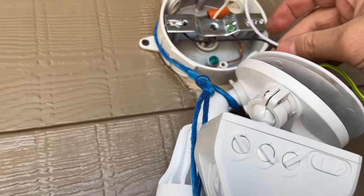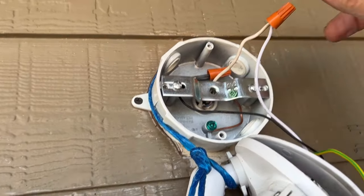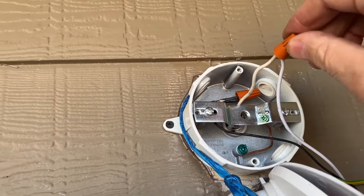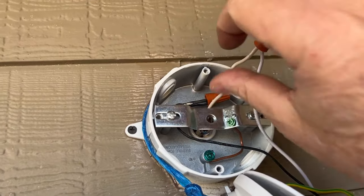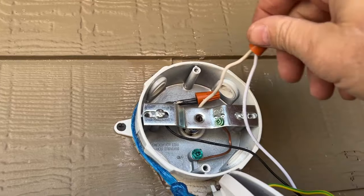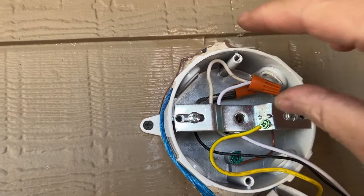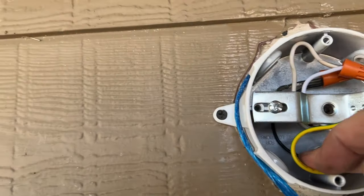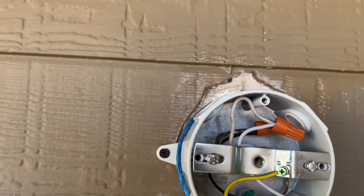Here's where I screwed up my stupid wires. My black wire I put under this so I could connect it and all my wires would be behind this. However, my white wire — I forgot to run it behind it. So now one's on top and the other one's on top too, and when I try to bend it this wire is going to be over this. So I have to undo this and run this behind it so they're both on the same side. I could probably just take this off and reapply it instead of unwiring it. Either way, one does the other. Okay, wiring's done — white's there, black. So much easier to work when you have room and you're not trying to shove all these wires in here. I still have to get these little wire clips down the bottom here. Got my gasket on and seal it up, put my center screw in and she'll be good to go.